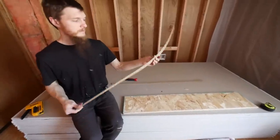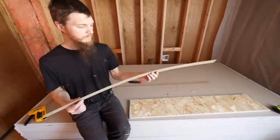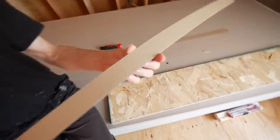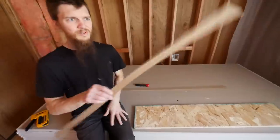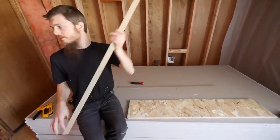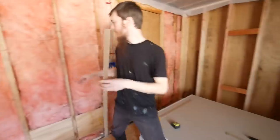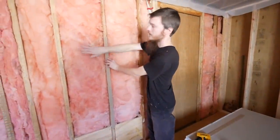These are builder shims or drywall shims — basically a piece of thin paperboard cardboard. You can usually find these at building supply stores. They're basically for shimming out studs. If you have a stud that's not straight and you're putting your drywall up, you can put these on the face, staple them on, and even out your wall.